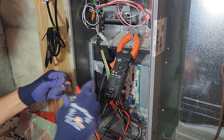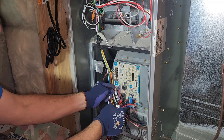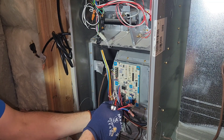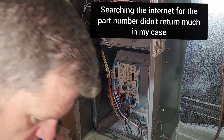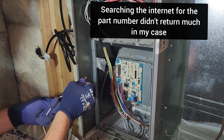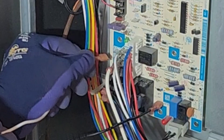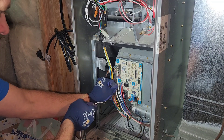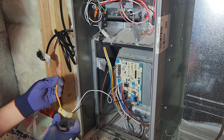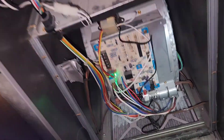So in order to buy a new transformer, I just looked online for a 24 volt transformer, made sure that it accepted 120 volts AC and it output 24 volts AC. And since I'm in North America, just made sure it had 60 Hz on there. This is the new transformer — it has the exact same specs as the old one. It was pretty easy. I could just unplug the old transformer wire plugs and then just plug these in their place. We got a green light, so that's good.